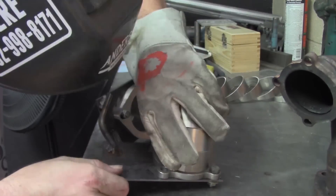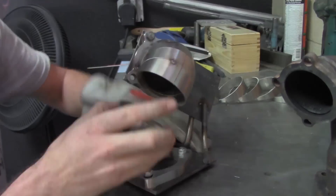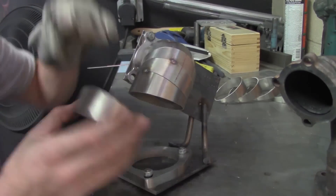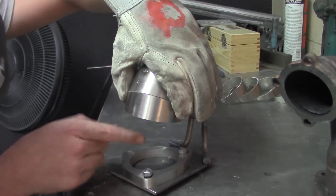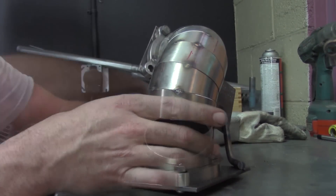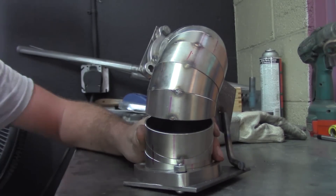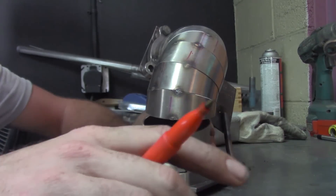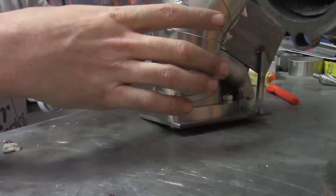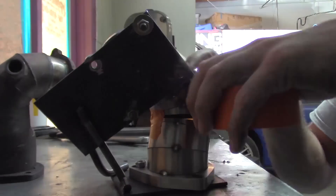You saw this in the forward facing turbo manifold episode and a couple of other ones. I think the jig episode — I mentioned the actual jig that I made here. So we're duplicating this dump tube that's on the right there. After I get this 90 assembled, notice that I'm going to change the direction of that piece of pie — I clocked it and aimed it down for that hole. So you can actually see that there's a complete change of direction. I'm going to do it a second time with this other piece here. So these two pieces I just added are actually both clocked in a different direction. And now I'm going to start from the bottom and work my way back up. These three pieces that are set up here are actually on three different axes — they all clock a different direction — and that's to actually change the direction, which is one of the biggest benefits of pie cuts. So when somebody says they're stupid or useless, well, you can't really do this with a mandrel bend, and that's another big reason why we use it.